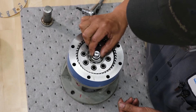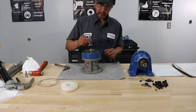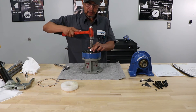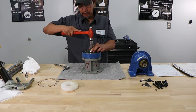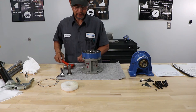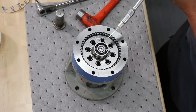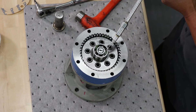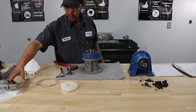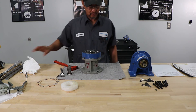Next is the top spacer. Next is the top bearing, and we use a jig to install the top bearing. The jig is designed to have impact on the inner race only. Add more grease to the bearing — this is to ensure that the bearing is lubricated at the initial startup. This size unit, in a single reduction, is a grease-for-life unit, so we always want to make sure that we're doing a proper lubrication application during the assembly.